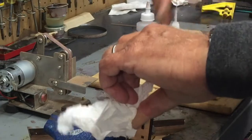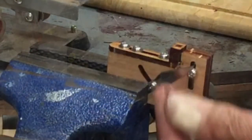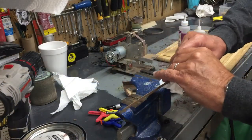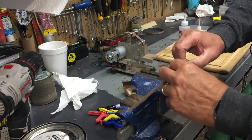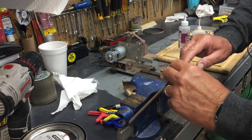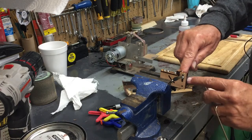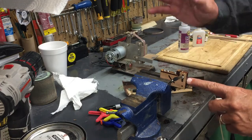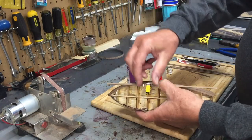I get as far as I can, just hold the tip of it, gently push down and pull. You can see just a small amount of wood sliver. I do it a few times so it's at a pretty consistent level. If I need to get that last little piece, I'll pull it the opposite direction a couple of times, but that puts the residue inside the groove, so you don't want to do that often. I just blow through there to clean it out.